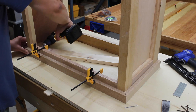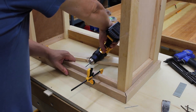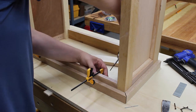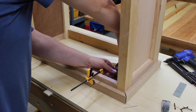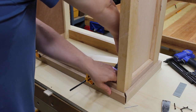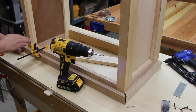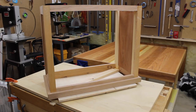I like a mechanical fastener wherever I can put one, even if it's just a couple of screws. I'll glue some things sometimes, but I've repaired and refinished a lot of antiques over the years. Anything that doesn't have a mechanical fastener will most likely come free over time — whether it's a dovetail drawer with a very tight fit, if there isn't some kind of mechanical fastener in there it's going to come apart no matter how long it takes. I know they had inferior glues 100 to 150 years ago, but I've even repaired current things where the glue separated because the wood expands and contracts.